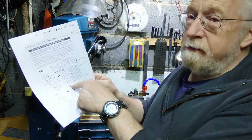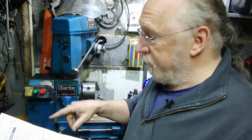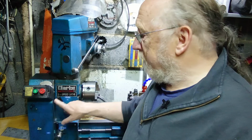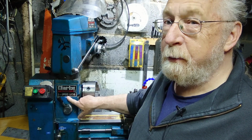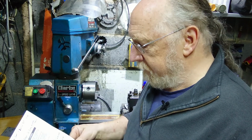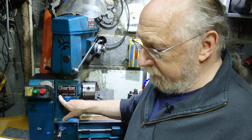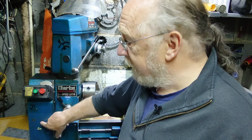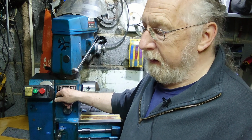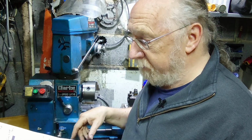And as we discussed last time, as you change the gears, the pitch will change. So what we've got is all using the gears to give us a ratio in this gearbox. Like I said, not this one, but this one, because I can't calculate that one because I don't know what size gears are in there, and I'm not taking my headstock apart just for you guys, just to let you know. So in here, this is what we're talking about, and we'll go in the back there and have a look at how we change the gears in a minute. This in the low speed position, the gear ratio in here is going to be 0.7. I would imagine that's 1 to 0.7. The website I was looking at didn't make it all that clear, but it was a good website for calculating the gear ratios. Anyway, slight digression.